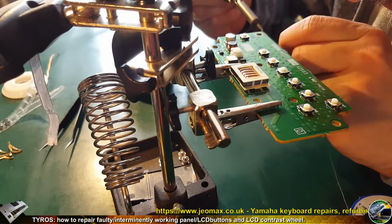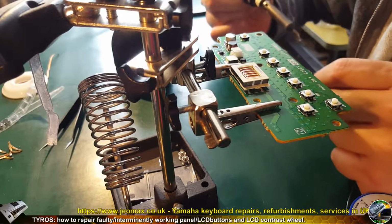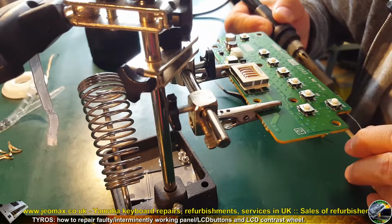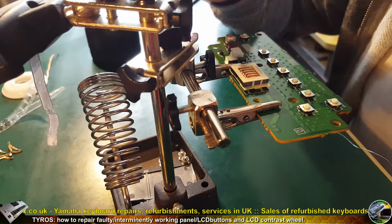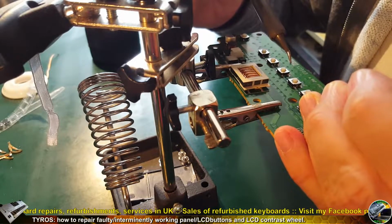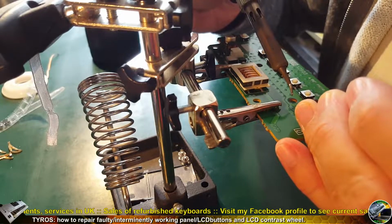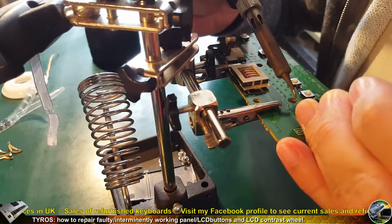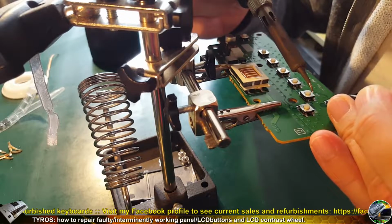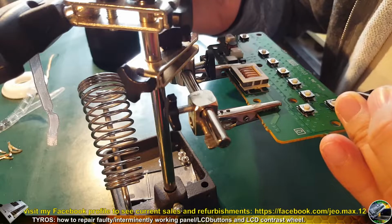As you can see, to solder the first terminal, I require some solder on my tip, on the end of the tip. It's not normal soldering, but it's the only way for sticking the switch to the PCB, and it's only done for the first terminal. So as you can see, tweezers try to keep the switch in place, and the right hand is soldering. It's done thanks to flux. It can be done before the flux from the solder oxidizes.